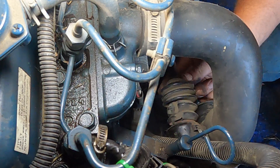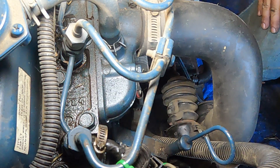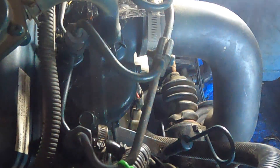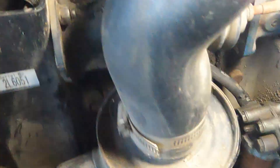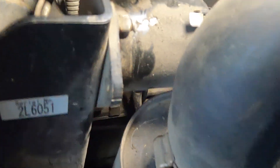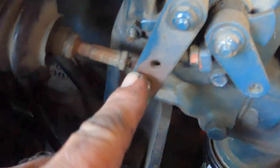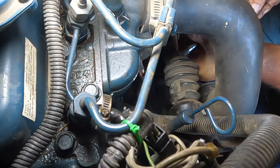What I want to work on first is the high idle and low idle solenoid. Before I work on that fuel line, I've got to address this — it stalls, or rather hesitates to engage to high idle. The white one with the red wire is definitely the one that goes on top. So now I've got a snap ring right there — I'm going to pull that snap ring out and then this arm will come out. And then when I unbolt everything I can take the whole unit off. It just presses in there a little bit hard.